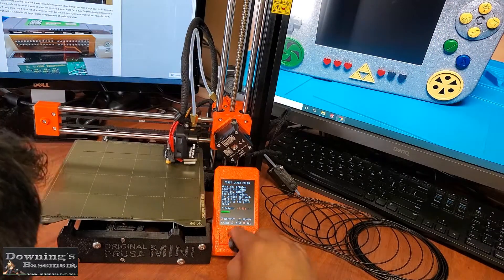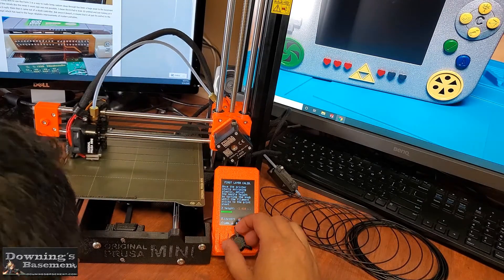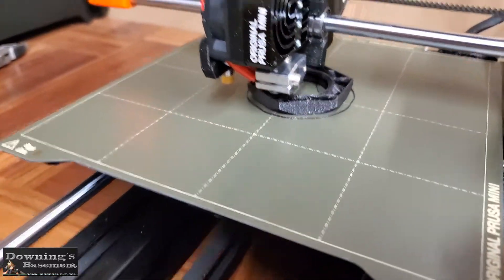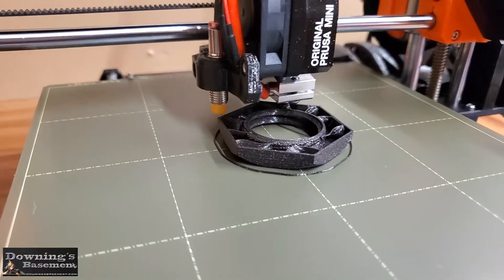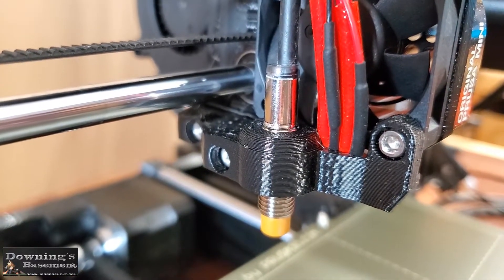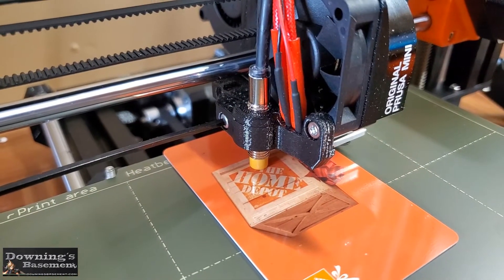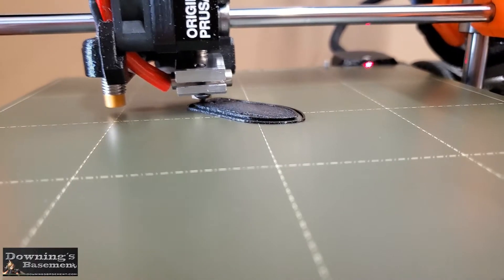But in my case, after the setup was done and there was a test print on the bed, something wasn't looking right. My first clue was that my Z height when calibrating was almost twice of what it should have been. It was right about here when I noticed an issue — as I watched the extruder circle over the part, I noticed that there was next to no clearance between the part and the Minda Probe. A tiny plastic booger would have easily made contact. After digging through the Prusa forums, I found that the Minda Probe was supposed to have two to three threads above the plastic clamp — I only had one. Fortunately, this was a very easy fix, and I've included a link in the description below with the steps involved. And after I recalibrated the Z axis, the newest addition to my print farm was up and running.